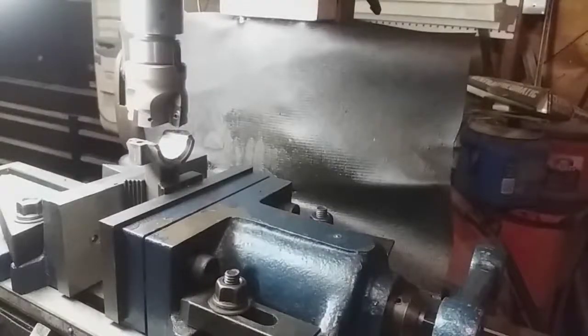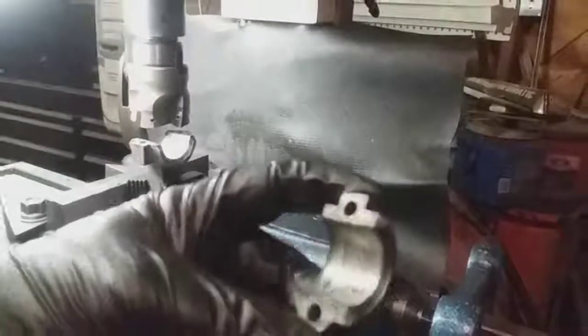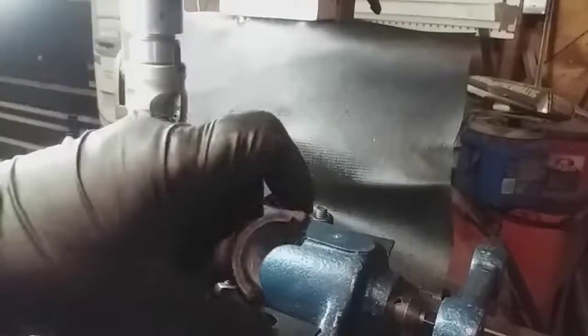After my first intro, this is the connecting rod for the air compressor. What I'm going to do is try to resurface it with the boring head. In order to do that - like they do with engine building, you know V8 or small block Chevy or whatever - they shave this down a little bit and then re-center it. This is just one cylinder and it doesn't spin that fast, so I don't think taking out a little bit here to resurface is going to cause much of an imbalance problem. I'm just going to do a couple skim cuts, take a few thousandths off each side, it'll be sort of oval, and then I'll open it up with a boring head.